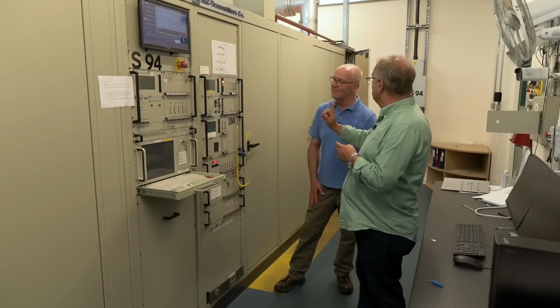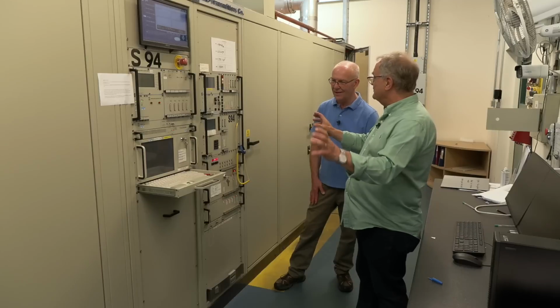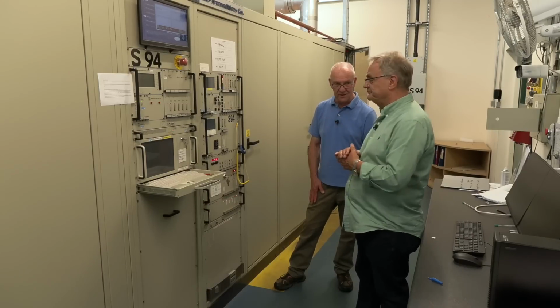But this is still a plate modulated tube? It is a plate modulated AM tube transmitter, but with digital modulation. And there's another important difference compared with the Marconi. How many tubes in this? One. Doing what? The whole lot. So 250k, one tube. So all the rest up to then is solid state? All the rest is solid state.